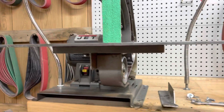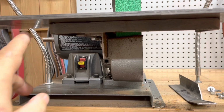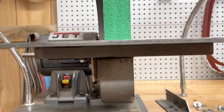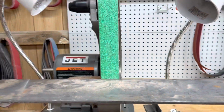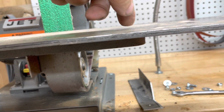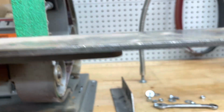I have another thought. I have three. One of them I've just decided I'm probably not gonna do, and that's to tack around here and a couple of tacks inside these holes, like that. But I don't think I'm going to do that. I want to make this where if I didn't like this, if it didn't work out, I could take it off. So I have two courses of action. Drill down and use my countersunk screws, which will leave, you know, 1/2 inch. Here's what it'll leave.